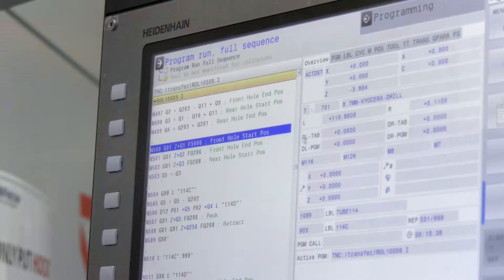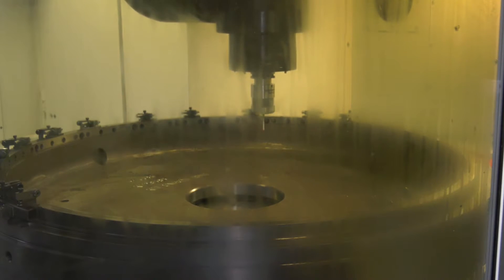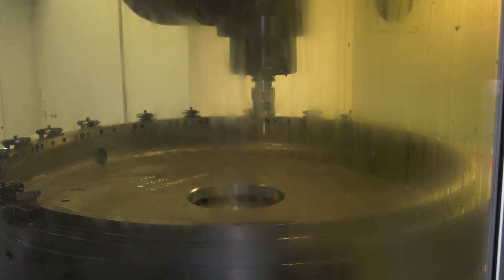For aerospace critical components, how important is accuracy and repeatability to you? Accuracy is probably the prime goal — we're constantly chasing those few microns. We extensively use probes for measuring the part, and throughout the process we'll come and recheck the datums and sometimes do an adjustment, because we're not in a temperature-controlled environment where this machine is, so we have to cater for the fluctuations in temperature. That's not just for the machine, but also the parts and the fixtures. It's a constant battle trying to squeeze that extra few microns of accuracy into the part.